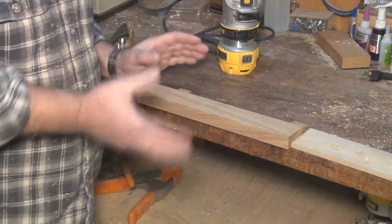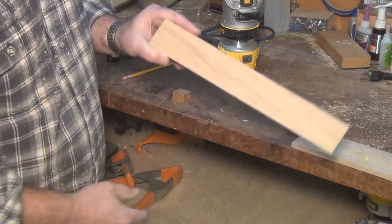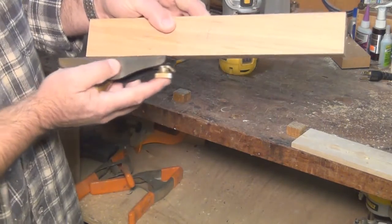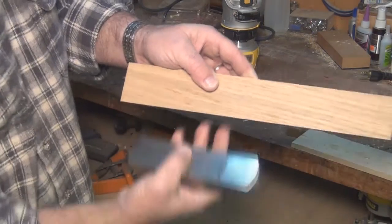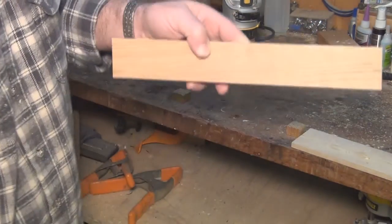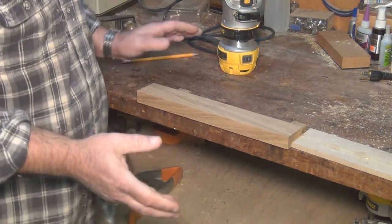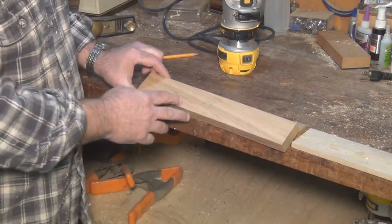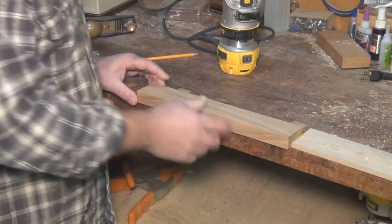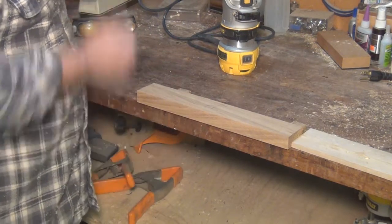Now we're ready to make a cut. There's a lot to think about depending on the wood you've got. I've got a fairly consistent piece of white oak here, but you can see the grain is going at an angle across it. If you've ever done any hand planing, you'll know that planing with the grain gives a nice smooth cut — but if you flip it over and make a cut the same direction, because the grain is going the other way, you might get a lot of chatter. That same sort of thing is going to happen with the router. The A side should give a clean cut, but when I flip it to the B side I'll probably get some chatter along that edge. I'm going to go pretty aggressively at this to see if I can make it fail.